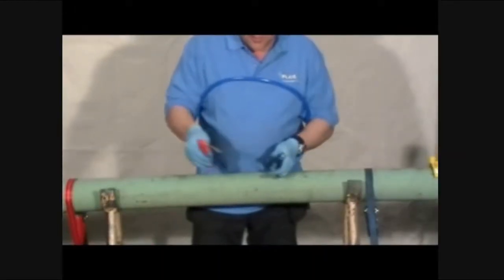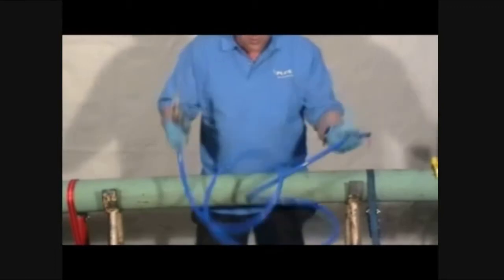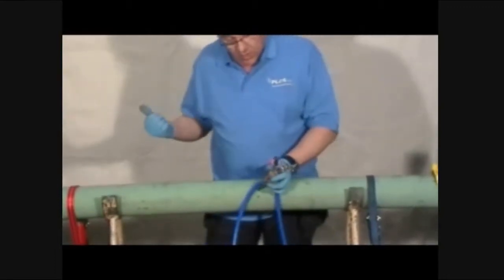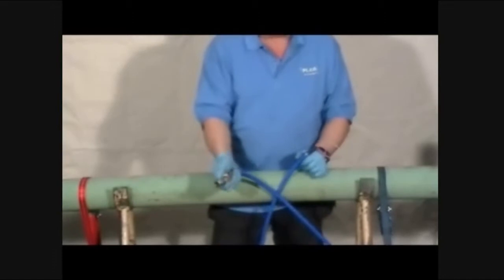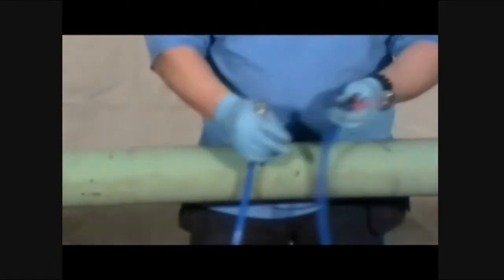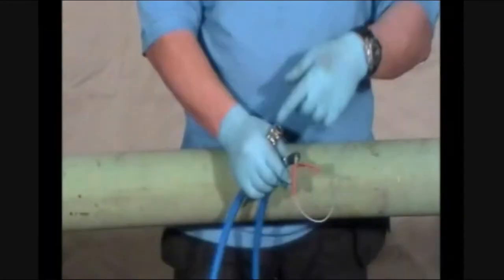It is especially useful for keeping the tool and work area clean from dirt and swarf. The dead man handle provides the air connection from the air treatment system to either the circumferential or longitudinal module. When depressed, it allows airflow to the cutter module. When released, air is terminated, stopping the cutter. All fittings supplied with a rubber cap should be sealed when not connected to prevent any debris ingress that may contaminate the cutter module.